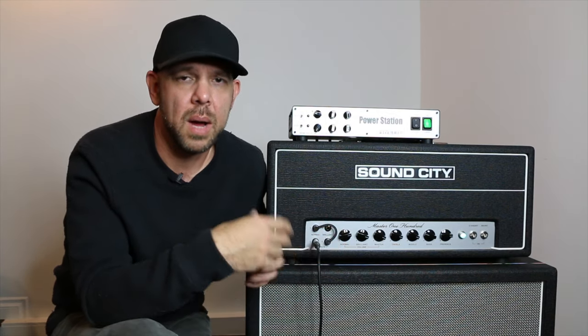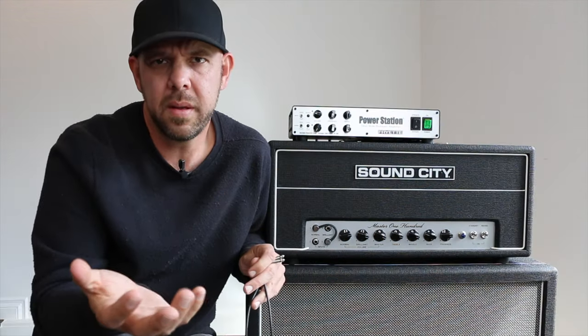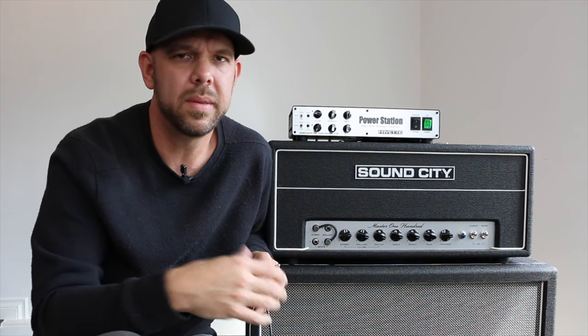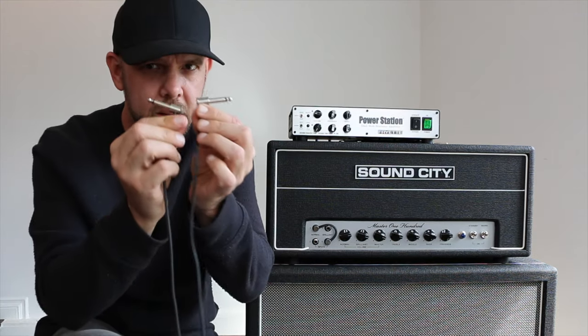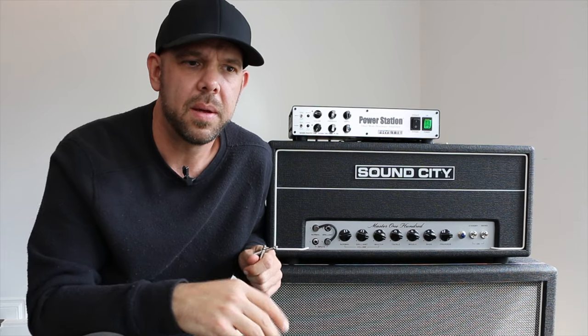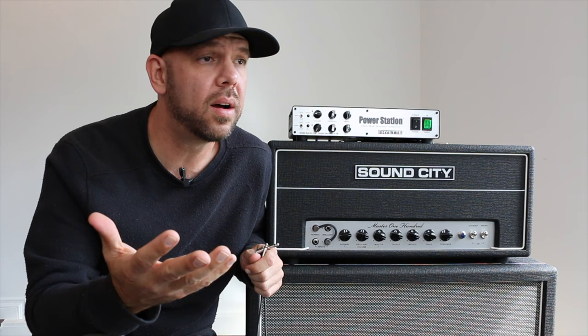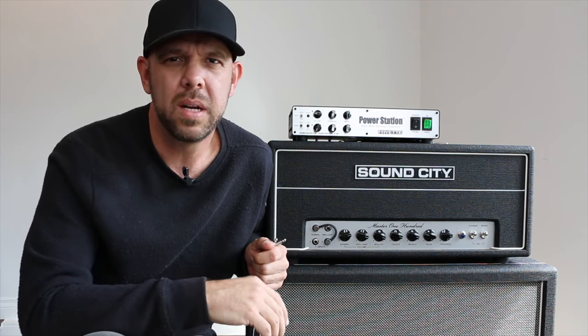It's worth mentioning that any time you use higher gain in your rig, you make it much more susceptible to these sorts of unfortunate utterances. Also, you can think you're doing everything right — running an isolated power supply, using high-quality cables — and still end up with a problem if two pedals are too close together, cables from each pedal are touching, or you're running a Y-cable out of one pedal splitting into two others. You get a situation where the ground of the pedal in front of the amp is touching the ground of the pedal in the effects loop, and you'll wind up with some pretty wild sounds.